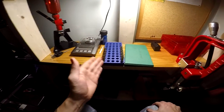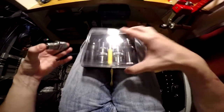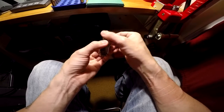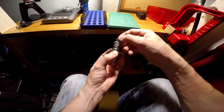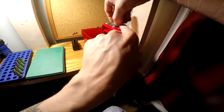The next step is resizing the range brass. The Perfecta cases need a full-length resize; the Federal cases do not. I'll go through all the processes for the Perfecta first, then the Federal, and once they can come together in one pile I'll continue. The first thing we need is the full-length resizing die. A lot of people wonder what the pin on top is — it pushes up when it encounters resistance. The general consensus is to just tighten it as much as you can by hand. Don't whip out torque wrenches; you just want to tighten it enough so that when you pull your casing out it doesn't pull the pin with it.